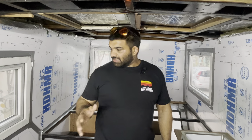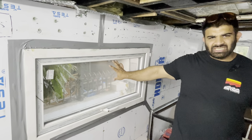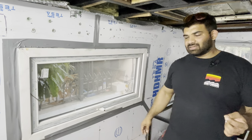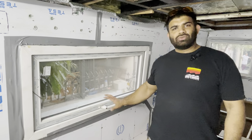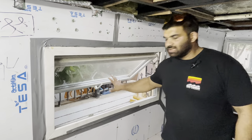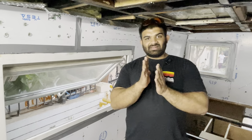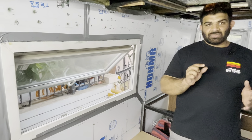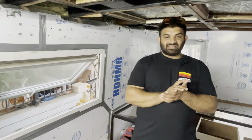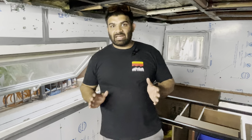Explaining the basic structure: we've got what's called DG glass, security glass, insulation glass — there are a lot of names. There are two glasses of 5mm thickness in a UPVC frame, which you find used in houses now regularly. We've got an openable window for ventilation. Between those two layers of 5mm glass is a gap of 8mm argon gas. For those who don't know, gas or air is the best insulator — there's nothing comparable to an air gap insulation.